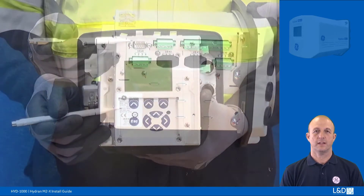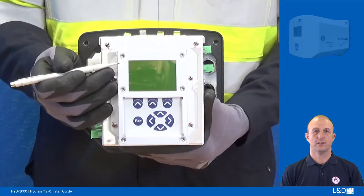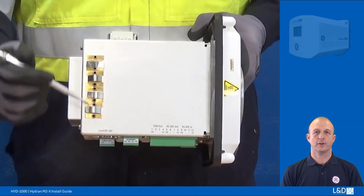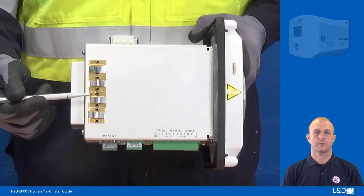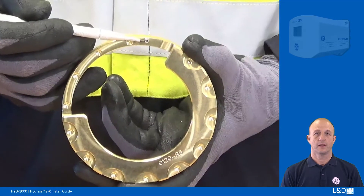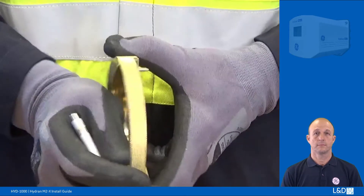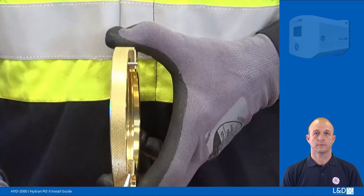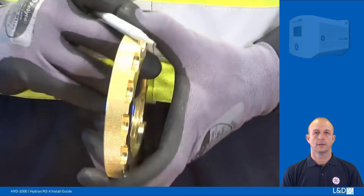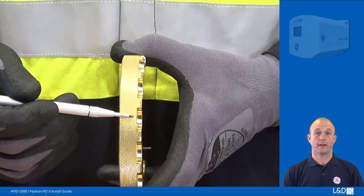At the end of the unit is the HMI with a simple press button operation. Above this is the LCD screen for viewing changing information such as gas levels and trending. On the top cover of the Hydran internal body are some spring clips to assist with cover location and retention. Securing the sensor into the base plate is the sensor securing ring with a small grub screw to prevent this ring from loosening during system operation. The securing ring has a reduced section — this should be aligned with the sensor bleed and manual sampling hole when fully tightened, and this section is reinforced to allow the C-spanner to safely tighten and loosen the securing ring as necessary.